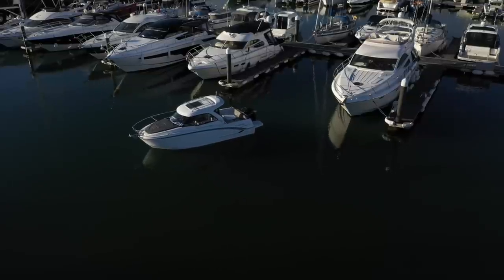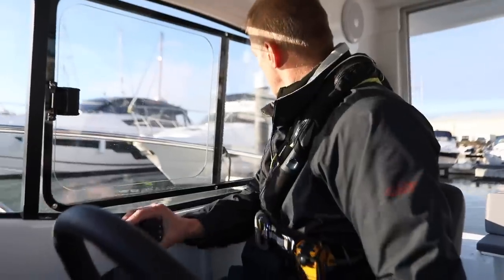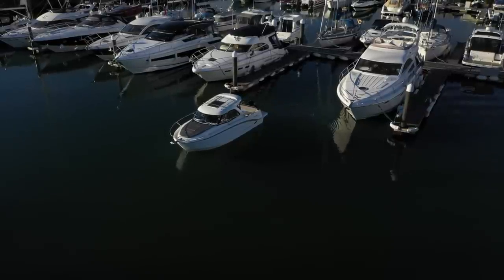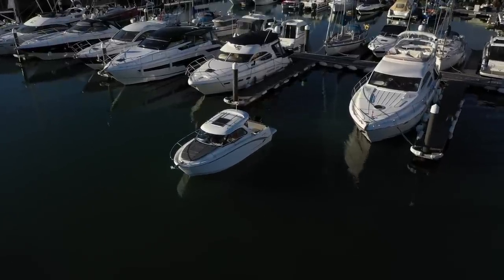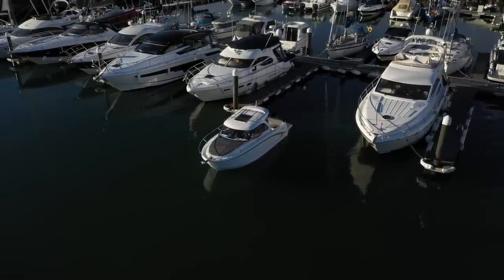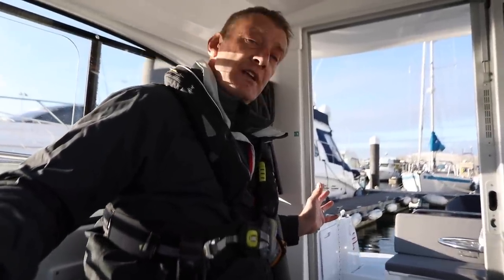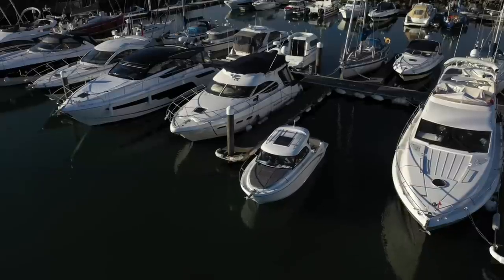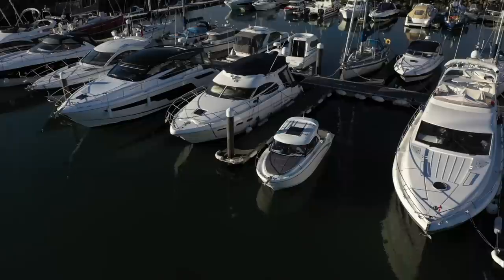If I'm not happy with the angle I can bring the wheel all the way back round to port and just have a little click ahead. You can use the engine on these outboards just like a gun sight — gives you a lovely view of what's happening. Going astern, because it's quite gentle which is a bit of an issue, it's actually also quite nice: going against those elements I can come back to neutral and my boat is just drifting in, with the wind acting really nicely as a brake. If I try to do this bow-in, because of the windage on the bow we tend to lose the bow at the wrong moment, and when we go astern to slow down not a lot happens, so it gets a bit scary.